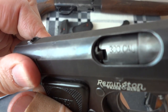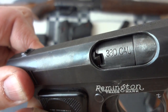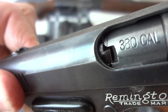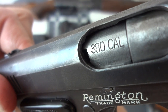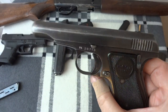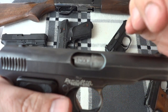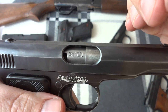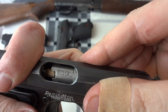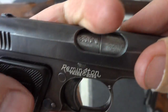If you look, you should be able to see the fact that the bolt, as I'm pulling back on the slide, the bolt stops right about there, and then the slide continues. And I don't know if you could tell, but it's actually tilting the bolt down in the back. Locked breech. What that means is that there's enough pressure in just that little bit to operate the entire cycle, but the gun is locked at that point while the slide continues back just a little bit more, and then it's able to open. So blowback, slide continues back.